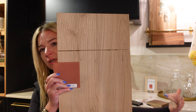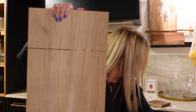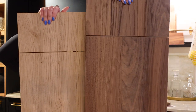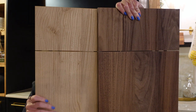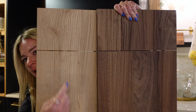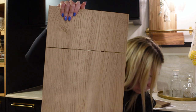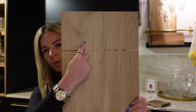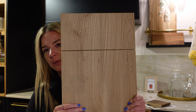I want to point out that these are two different laminate door styles. One was Firma, but Firma was not grain-matched. This door is actually the Fusion door — it's also a vertical grain pattern, but you can see it is grain-matched. Very big difference and something to look out for. A lot of times we'll do a door that's not grain-matched, but you have to be aware of that, or you can pay extra for a door where there is a lot of effort put into ensuring these drawer fronts vertically are grain-matched.